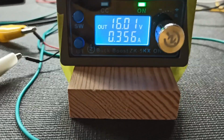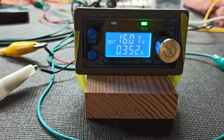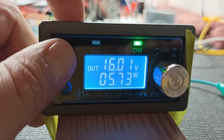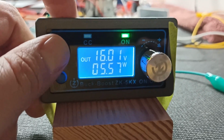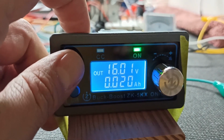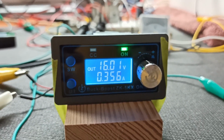Once our voltage and our amperage is like really, really low, I mean, you couldn't even shave with this much. This wattage is ridiculous. I think I could get the wattage on the interface here, the switch. There's the wattage. It's 5.6 watts. For most modern shavers, you need about 20 watts. So this is, I don't know, maybe peel an apple or something. Any rate, amp hours, 2 minutes. And so here's our amperage. So less than 400 milliamps.